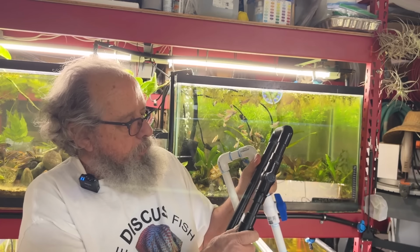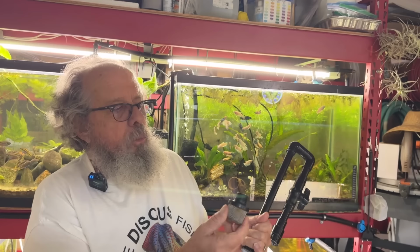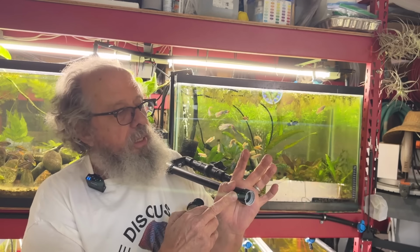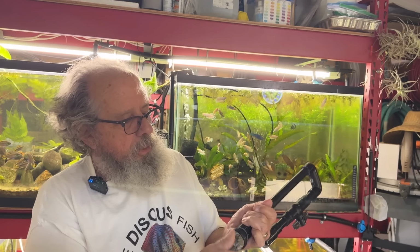So when I drain the tanks, I would use this piece of PVC pipe with a ball valve, and this fitting here on the end, which comes off of a Graco airless paint sprayer. These are hose threads here. So on the end of this thing is a hose fitting that goes into 1/2-inch PVC pipe. So that just threads right in.